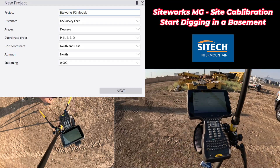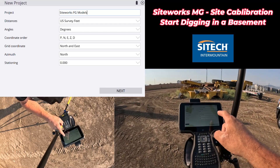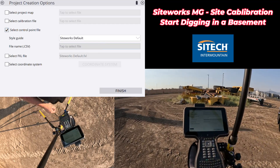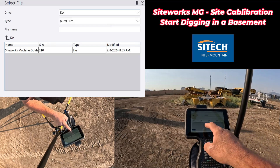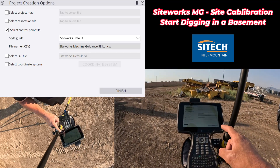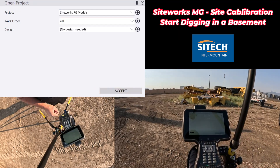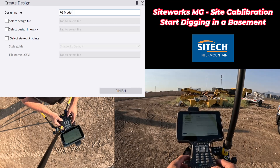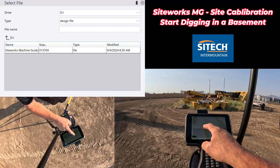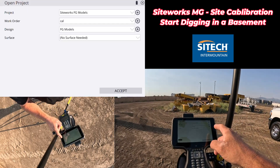What I've got here is a VCL file. With all four of those different designs, I've got one file that's going to take care of this. We'll leave it as US survey feet, point northing easting — that's my control. We're going to bring in the control points from my CSV file. I'll go to my thumb drive, find the southeast lot CSV, and hit finish. Then I'll go ahead and set up the calibration, name it 'Finish Grade Models,' bring in the SiteWorks VCL file which has all those models in there. It will auto-populate both fields, and we'll hit finish. Project is set up.